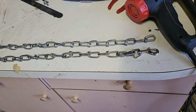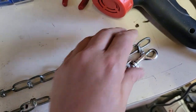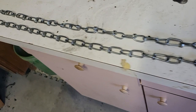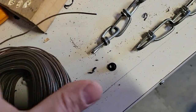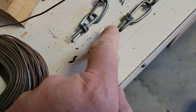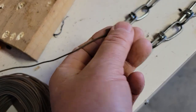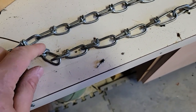I cut a little bit of chain — it's kind of a light-duty chain, like a dog chain. I'm thinking if this gets jammed up in the notches of the disc, hopefully it'll break before it damages the disc. I'm also going to take some of this wire — this is like rebar wire — and loop it in with that. This thin wire will be the thing that breaks first. I don't think I need anything heavier than this to keep the mud out of those discs.